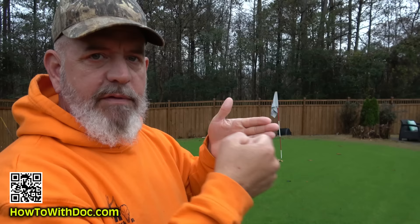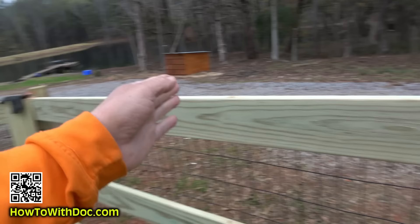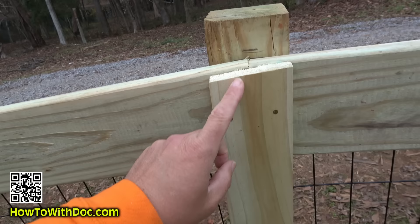Every time you have a gate opening you want to use a six-by-six post. Every other post is going to be a four-by-four — that's pretty standard in the fence industry. Once those are mounted in, they unroll black wire and use a pneumatic stapler to staple the wire on. Then they come back and put the cross boards, which are one-by-sixes across it. Where those one-by-sixes meet, they put a one-by-three strip on top of that joint. I like to use caps on top of my fence posts as a nice finishing touch — they brought the same brass or copper top caps.